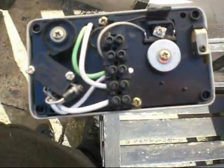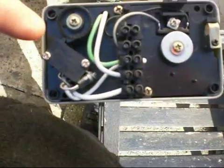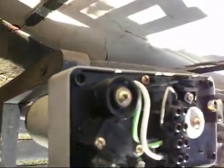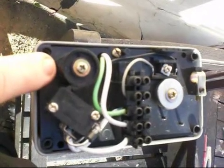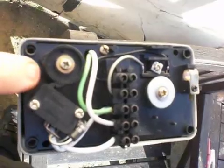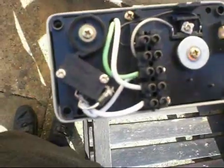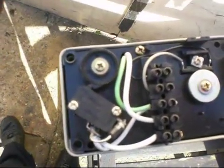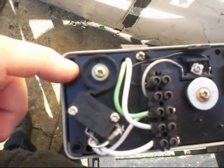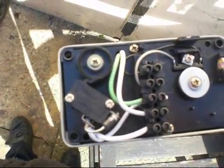The way these work, there is actually a plastic cam gear — a little plastic cam gear. You can see that's loose a little bit. On this gear there are two wheels held by a screw. As the actual motor turns one way on one polarity, one of these little cams goes up to the little micro switch and switches it, switching the motor off. That's your fail-safe for the end of movement in one direction. Then when you reverse the polarity, the other cam moves in a different direction, comes around to the other switch, touches the little micro switch and switches the motor off.